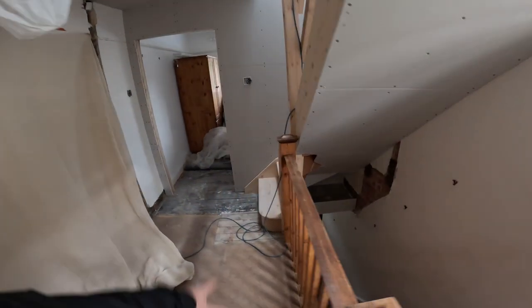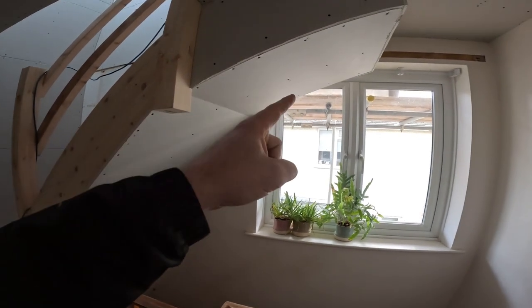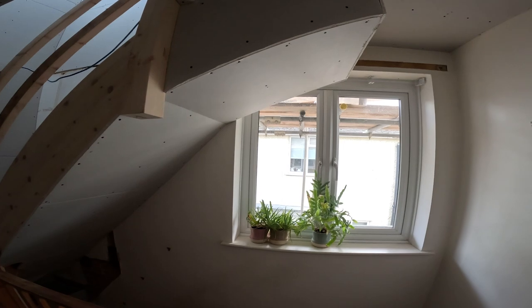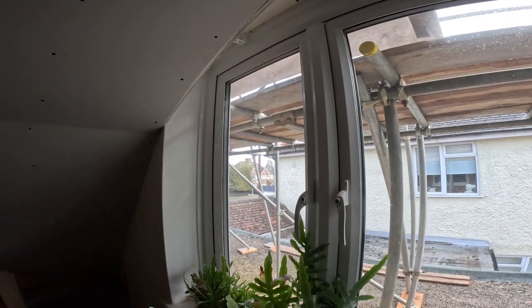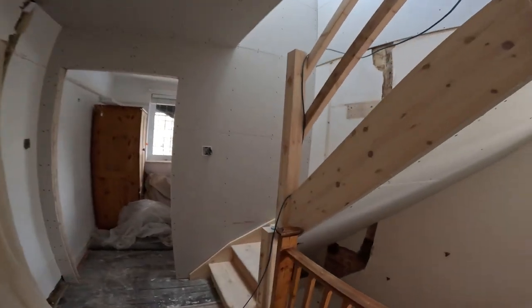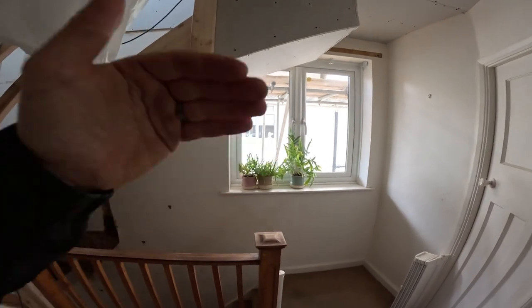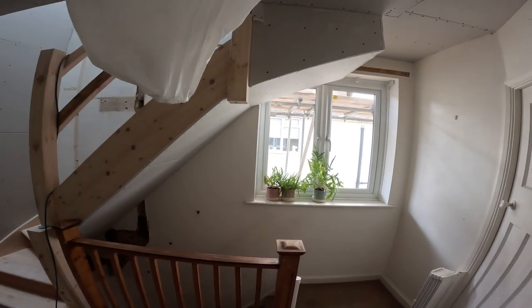Originally we boxed this off, but the client was really keen to keep a little mini niche just for storage, which will probably look quite funky once it's plastered. There are two main challenges in a loft: head height in the loft itself, and head height for the stairwell. There's a slight trade-off in that the top winder overhangs the window, which is a pretty normal scenario in a lot of lofts — it's one of those compromises, because the original house wasn't designed for another set of stairs to go up over it.